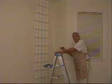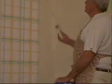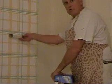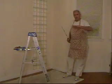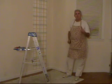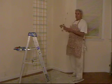Corners are very rarely ever even. So what we do is measure three places when we're going into a corner. We measure the top — here it's eight and an eighth inch. The middle is eight and three quarters inch. The bottom is eight and three quarters. We're going to put three marks on the piece of paper and use the largest of the three measurements, which was eight and three quarters. So we're going to cut the left piece at eight and three quarters.